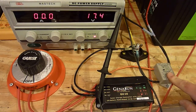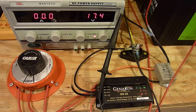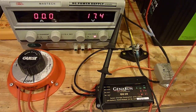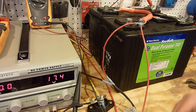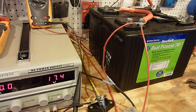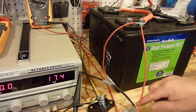The difference between the two is that the shunting controller basically connects directly to the batteries at any voltage below its set point, which is 14.2 volts. Once it reaches 14.2 volts, it begins turning on and off — it'll hit 14.2, turn off, allow the battery voltage to drop back down to 13.2 volts roughly, then kick back on and bring the batteries back up to 14.2 volts. So it can take a very, very long time to get the batteries 100% full with a controller like this.